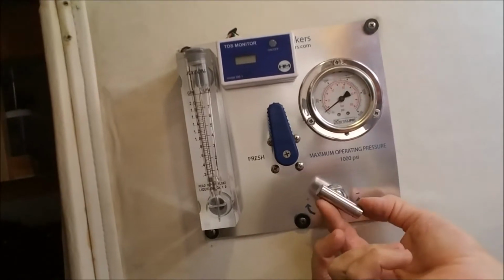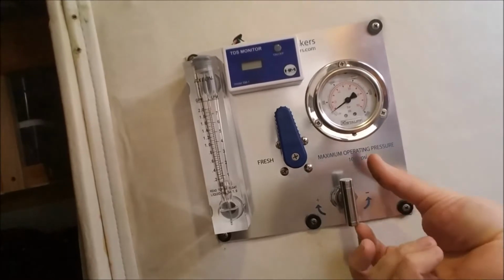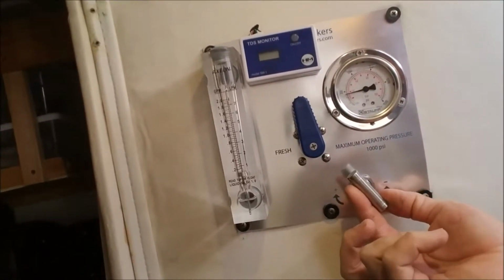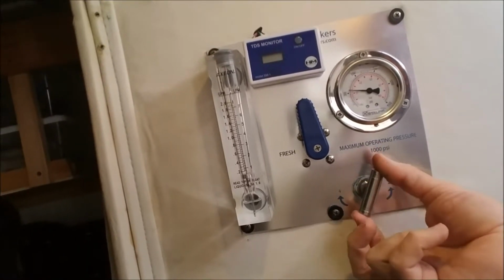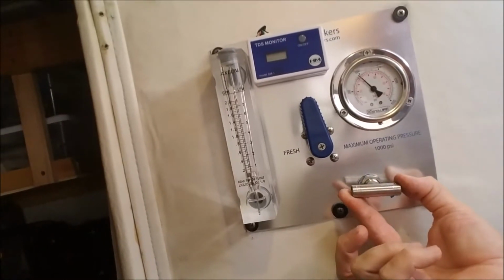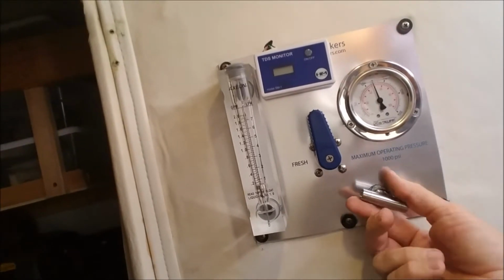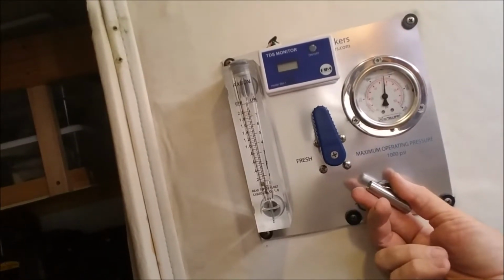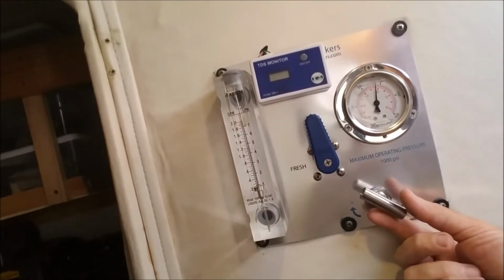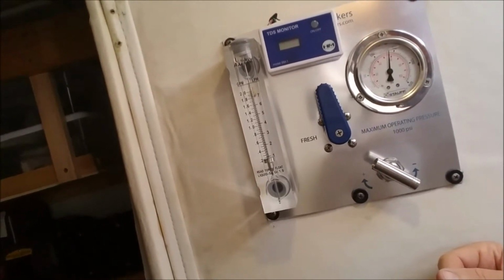And there's the pressure coming up. And this is showing how much water we're making per hour. So you won't see anything until we get above 600 or 700 psi. So here we go up. I'm hearing the restriction in the valve. I'm seeing the pressure go up. So right about here, we're starting to see water getting made. In fact, you can see it bubbling up right here, and there it goes. So now we're making water, and we're making about 12 gallons per hour at that setting.